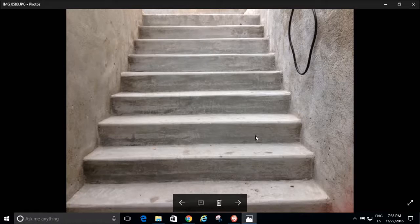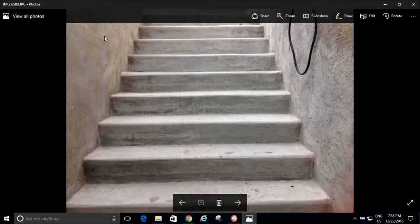Well, that's how my stairs turned out. Not too bad. You can see a few little cosmetic defects, because I had to add some water to these when I was finishing it off, and then I had to add some little stucco techniques, because now I'm an expert plasterer, and I say that with sarcasm. You can see it turned out a lot rougher than I wanted it to, but whatever, right? So I mix my plastering with there and I finish them off. This is probably not fit for the Queen of England, but I don't care, right? It's functional. And on the next one I'll do it better. But on this one, I had to torch all my bleed water off, okay? So we hit them too hard with the torch and then it set up on me. So that's what happened. But I'll know better next time.